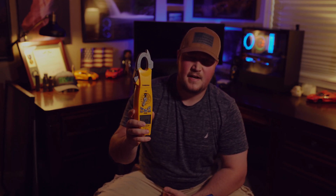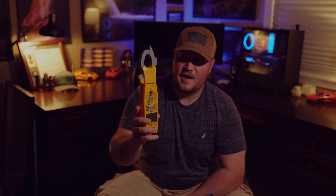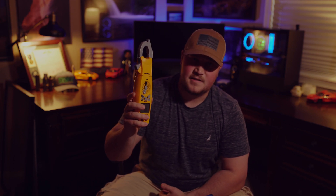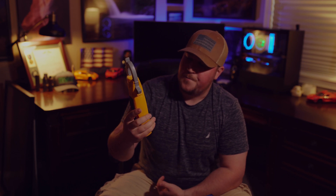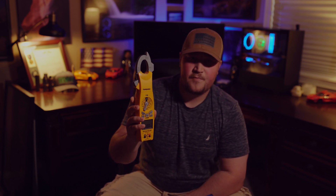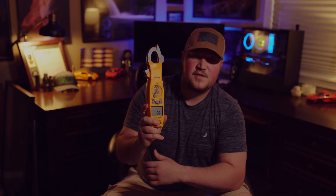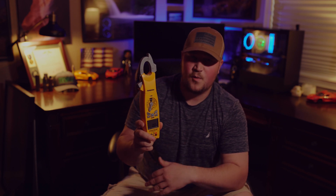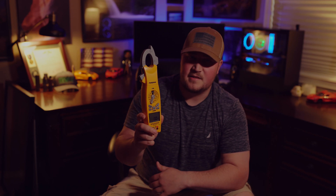So that's one thing to keep in mind if you're purchasing this and trying to get frequency readings off of motors. Looking around online on the specs on FieldPiece's app, I didn't see anything letting you know there was a minimum amp rating for this function. That 7-amp minimum is for the range from 10 to 100 hertz. And then from 100 hertz to 400 hertz, it is a 20-amp minimum. So keep that in mind — if that's one of the main reasons you're looking at getting this, make sure whatever you're going to be checking is going to be pulling at least 7 amps, otherwise that hertz feature is going to be basically useless to you.